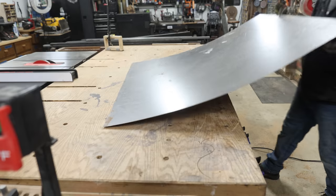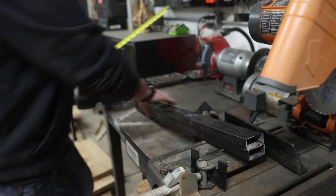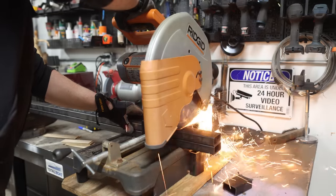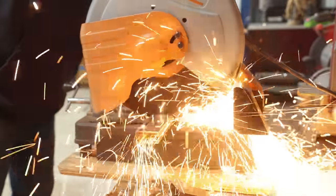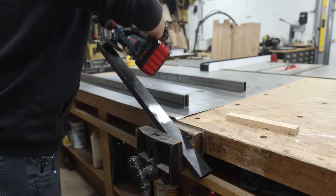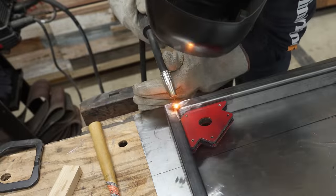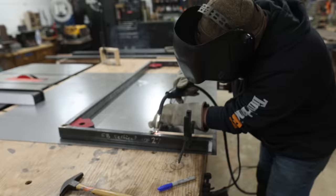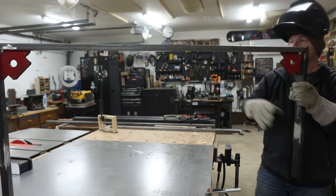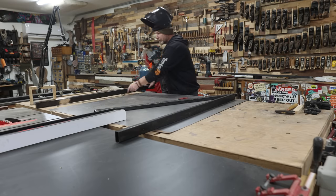While the glue dries, I can tackle the bed frame, which is made out of 1x2 16-gauge tubing. I cut all the sections I need at my chop saw and started grinding all the areas where I'll be making welding connections. When you're welding you want that metal completely bare, and this tubing has a protective coating that needs to be removed first. With my metal cleaned up I can start tacking the footboard together — these magnetic corners are really helpful for getting a nice 90-degree angle, and I use them all the time when welding.